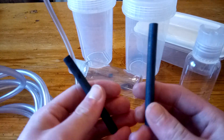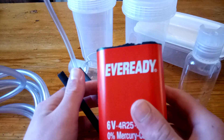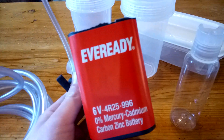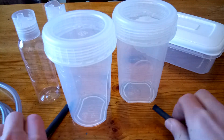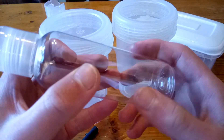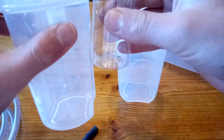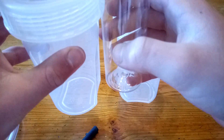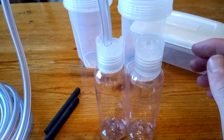To make a hydrogen generator you need some electrodes. I'm using graphite rods I got out of this lantern battery. I'm using graphite because it does not corrode. Now these plastic containers here are food containers and I'm going to make these into the main body of the generator. These travel sized bottles are going to be used as funnels in order to collect the gases, and they have a nice top which I can connect my vinyl tube to.